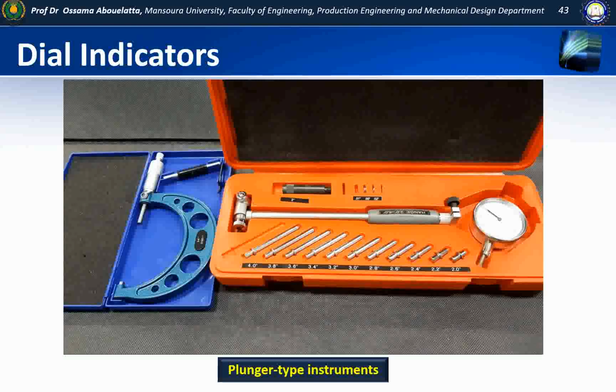The next part of our inspection is going to deal with measuring cylinder bore wear, cylinder bore out of round, and cylinder bore taper. Now, this could be accomplished with a telescoping or snap gauge and an outside micrometer, but by far the most accurate way to measure these things is to use a bore gauge.